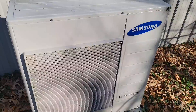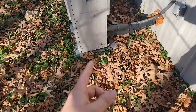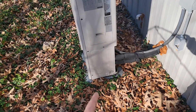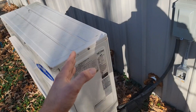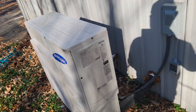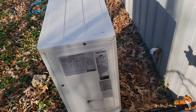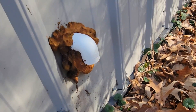If you have any questions, drop those in the comments section — questions lead to content. This right here is my outdoor unit made by Samsung. I can install it on a wall mount bracket up off the ground, or I can get a pad that's 3 inches tall, 36 inches long, and about 18 inches in width. It's 220 volt. Never buy a mini split that's not 220 volt — if you get 110 volt you're going to have double the power consumption. Here's where the drain comes out for the cassette, and here's the drain for the wall mount air handler. You just take a shop vac, put it right here, suck it out, and you're good to go.